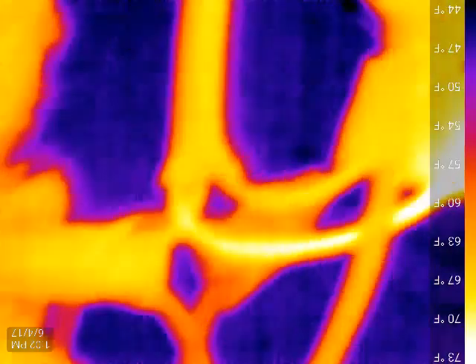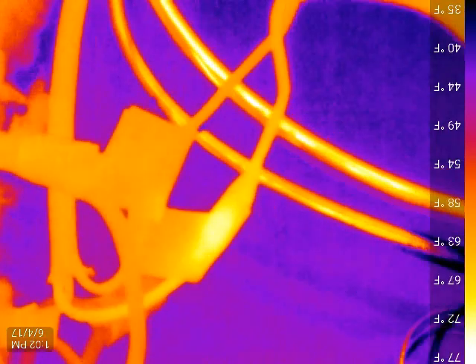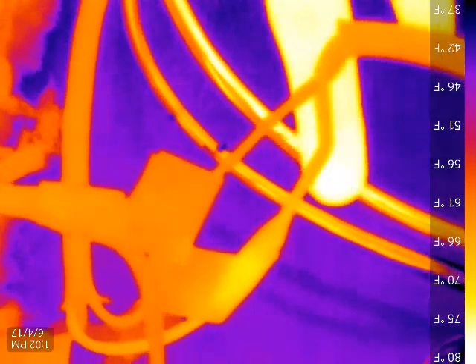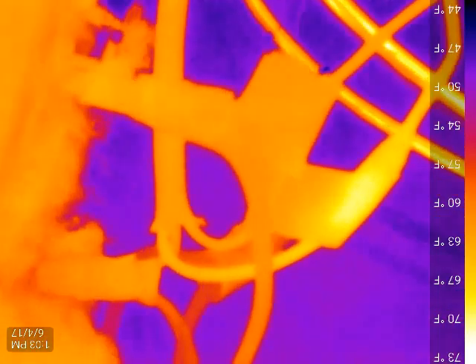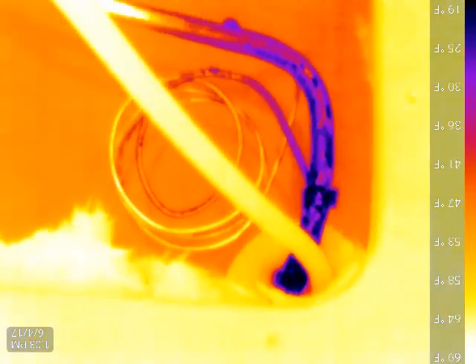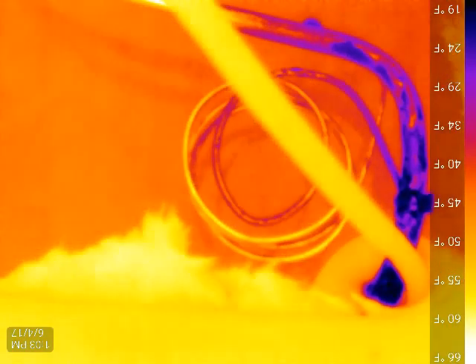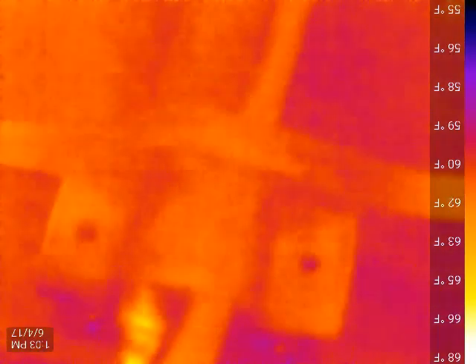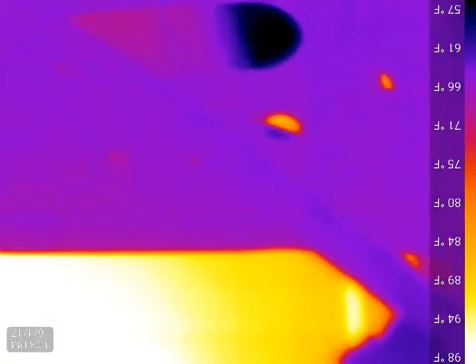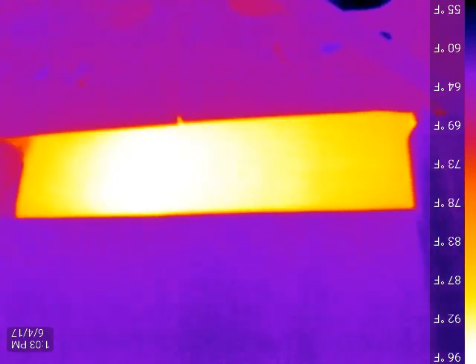Here's another thing I forgot — I do need to fix this. We have a hot electrical connection right there, slightly warmer, but since I can actually see it, I should tear it apart and fix it. There's a reflection coming off that condenser behind me, so this copper tubing appears warm. But there's a little bit of water condensate on this uninsulated suction line — it is cool coming back — so that's all got to be sealed up. I also noticed that once this compressor really warms up, the center of it does get a little bit warmer than the sides.